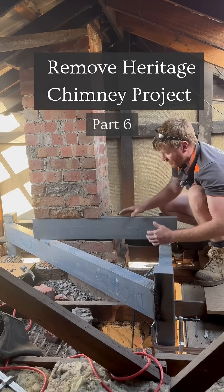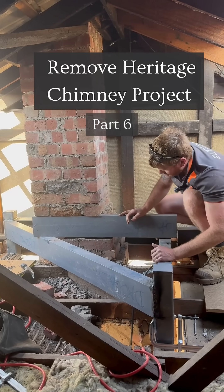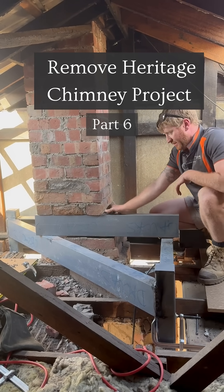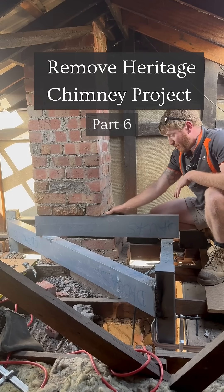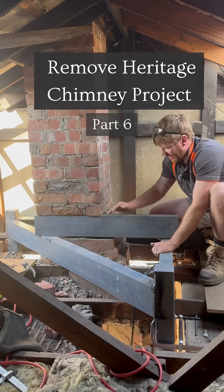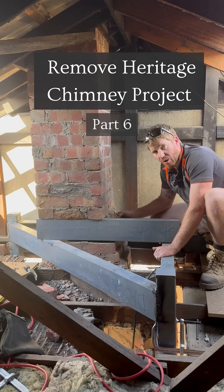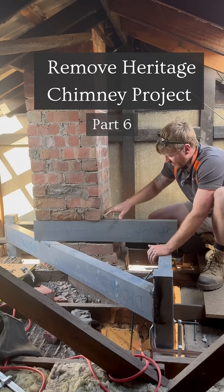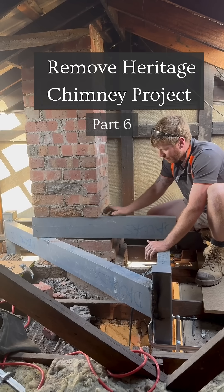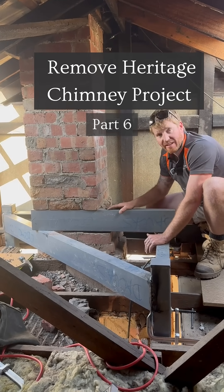I've done one side here — probably the easier side access-wise to give us a good look at what's going on. What I've done is I've just chiseled out one brick width, essentially one brick width wide which is about 110mm. The key to this is to not undermine the whole chimney, so this has got to be done in stages. This is the first stage — taking out the 110mm brick and then putting our PFC under it. We'll completely weld this off before we attack the other side.